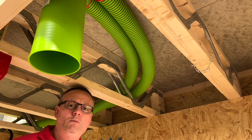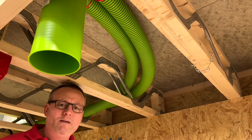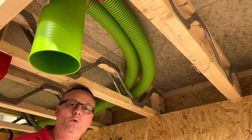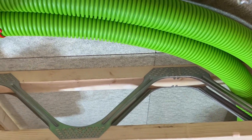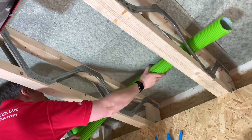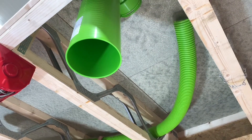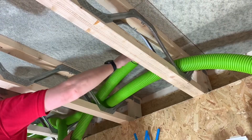Now we're at the room end. It was a really easy process from our MEV 160 to here to install this fast track semi-rigid ducting. For more information about different types of ducting and how best to install them, check out our CPD - I'll leave a link in the description below. We're pulling in the 75mm fast track; they also do a 90mm version as well.